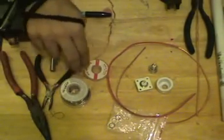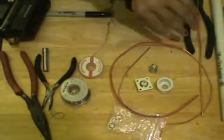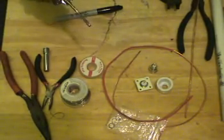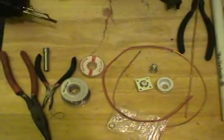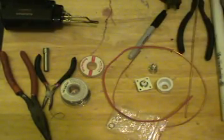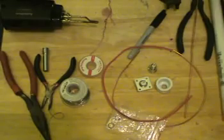Typical tools: we've got a couple of pliers, some solder, desoldering braid, some wire, some cutters, and a soldering gun in this case because I'm using such thick wire. You can still use a soldering iron. You need a marker, ruler — metric, of course. That's about it when it comes to tools and supplies.